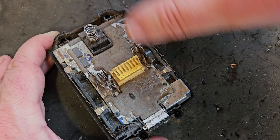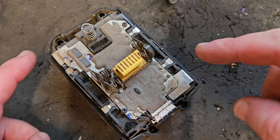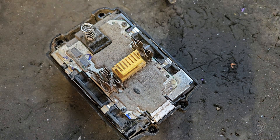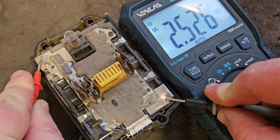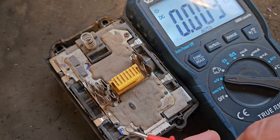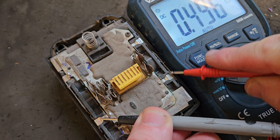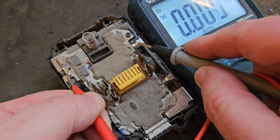I've already taken the screws out and I'm going to test if there's anything on these ends. The board isn't carrying the voltage through — if we bypass the board and go directly to the pack, we get 2.52 volts, which is pretty bad. Testing individual banks of cells, we're not getting very much: 1.53 volts on one, 1.49 on another.